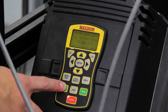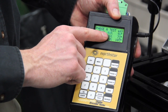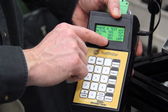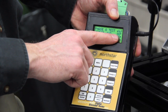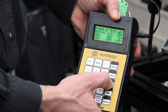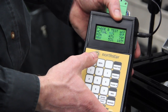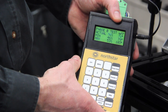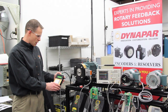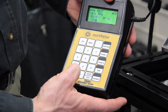I'm going to go ahead and turn on the drive. The first function we'll check is the A pulse — the symmetry of the output of the encoder is shown here, approximately 50%, which is the same value we received on the oscilloscope. The phase relationship between A and B is shown on the right-hand side, with an actual min and max displayed for each one. B is toggling between 50 and 49%, with a minimum of 40% duty cycle, a maximum of 53%, and the phase relationship is also shown. In addition to the functional check, you can also verify the motor RPM by inputting the encoder PPR, and the motor output RPM is then displayed.